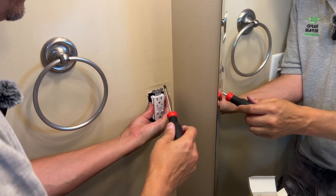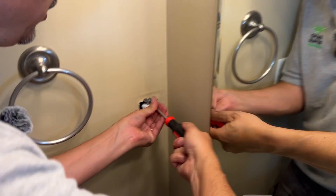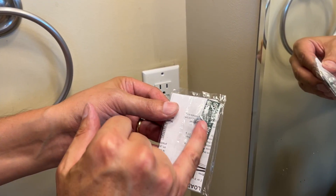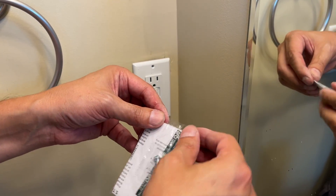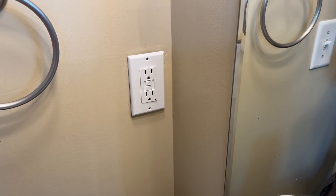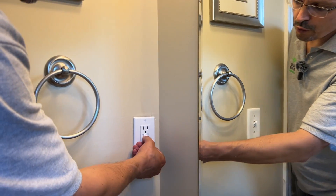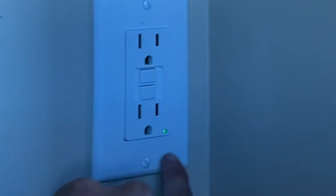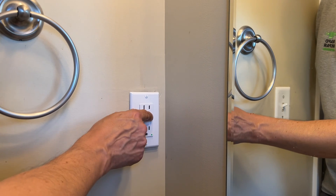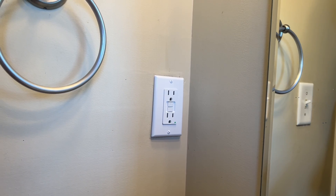With the electrical tape firmly in place, fold and tuck your wires back in. When screwing this in, you do have some play — make sure your outlet is level or close to level so it looks good and normal. In the instruction packet are the two screws for the cover plate as well as the safety stickers, and those are important. Power is restored — reset your outlet. The manufacturer green light means it is working, so you have fault protection and a three-prong, technically open-grounded outlet. Label it as such and you will be in good shape.